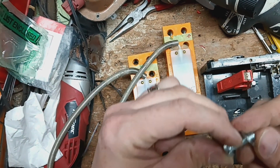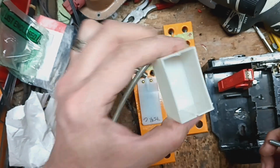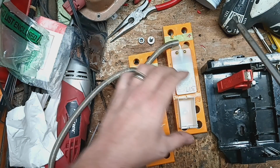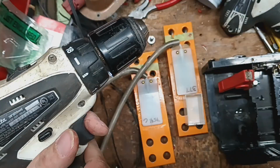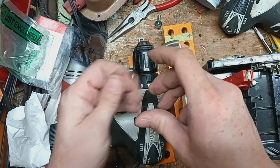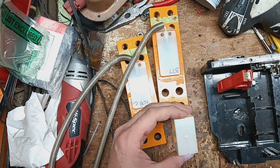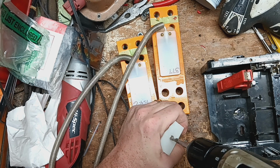Alright, so I usually put a washer on it as we're putting it in there because it kind of cushions. That's pretty thin little plastic. But it just does one thing. Once the epoxy gets in there and everything, it's fine. Okay, and you get a drill. This is where we've got to be kind of careful because you don't want to drill too hard to that thing and crack and break that stupid little plastic thing. Which I've done a time or two. I'm just going to get a bit that's about that size, should work. I don't know if this will be long enough. That'll work. Alright, we're just going to turn this down because I don't want it to grab and twist on me. Go dead center.